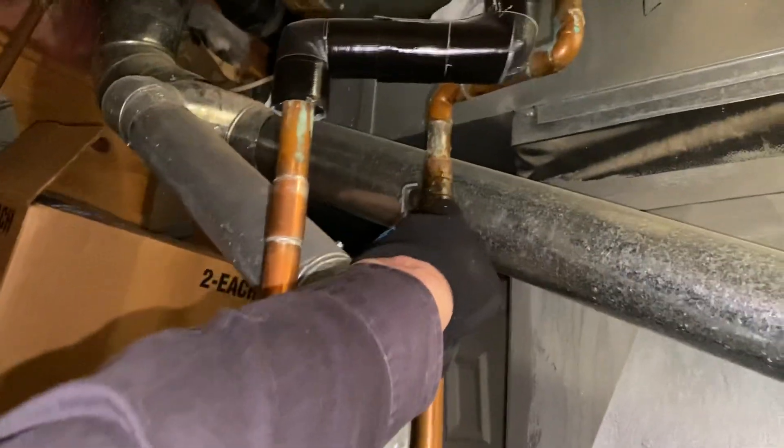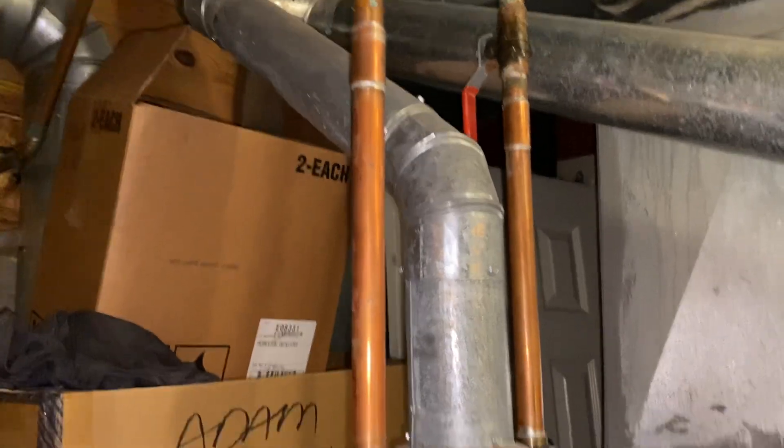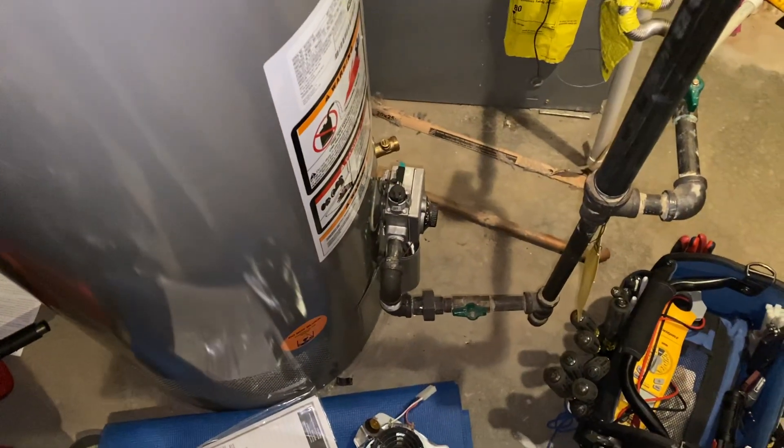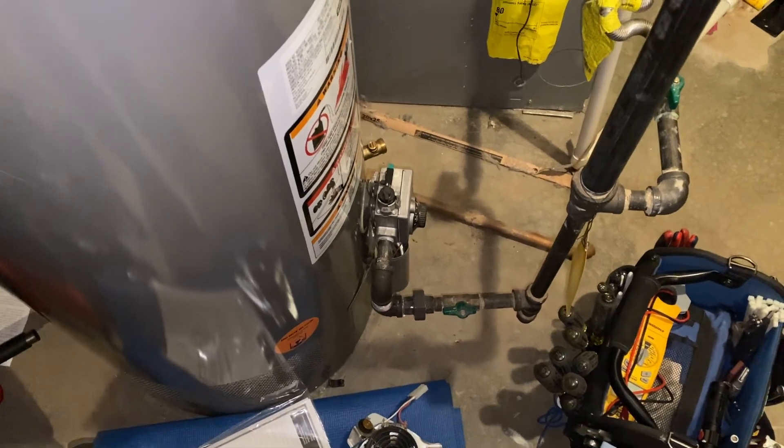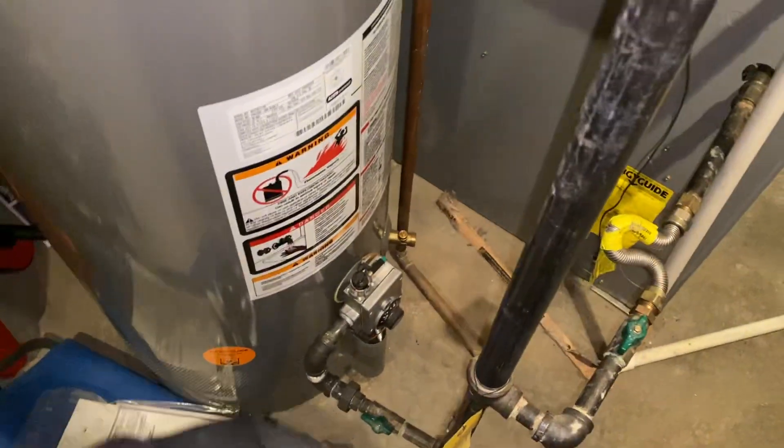How do I know? Because they left the old valve, there's no expansion tank, no expansion valve. And they just cheesed it in as best as they could with pretty much the same setup instead of having a breakaway. No hose going over, no pan, no nothing.